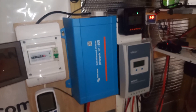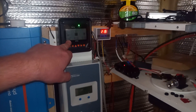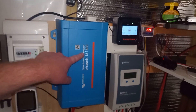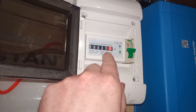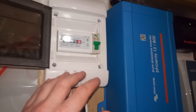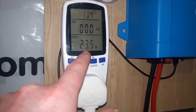I'm going to go make a brew because I've been out here for about an hour. Quick rundown: 40 amp MPPT charge controller, that's the MT50 display for the controller. The inverter is 800 watt pure sine wave, peaks at 1500 watts. There's the Bluetooth dongle for it, and the kilowatt hour meter showing 29.9 kilowatt hours used in the house. We only ever run a lamp and a laptop, charge a handheld radio - battery banks and USB - don't use a lot of power. It's just there for a power cut; the system's already running so we don't have to come out and start a generator.